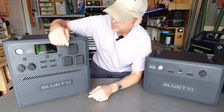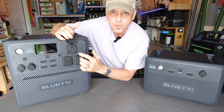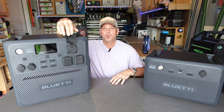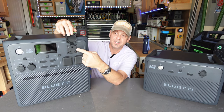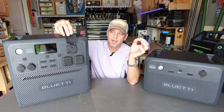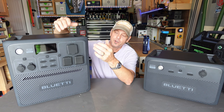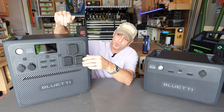This power station comes with what Bluetti is calling a 30 amp output — it's not a true 30 amp, but it does have that TT30 RV output receptacle. If you have a 30 amp or even a 50 amp RV, you can dog bone it down to a 30 amp plug and plug it into this. It's 2400 rated continuous watts, so not a true 30 amp, but you can still connect an RV or boat and get 2400 watts out of it.